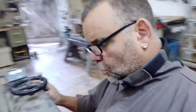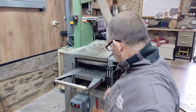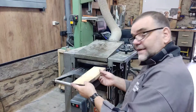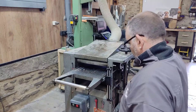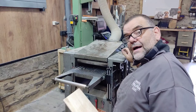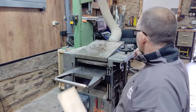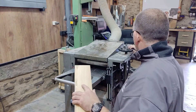That's a pretty fine increment — 0.01mm — which is actually too fine; nearest millimeter or half millimeter is good enough for me. To calibrate it, since this design is a little finicky, what I do first is run a piece of wood through the planer. Say I want to run something through at 23 millimeters — I always adjust the table height by coming up from below, so I'm always under tension with no movement in the table.